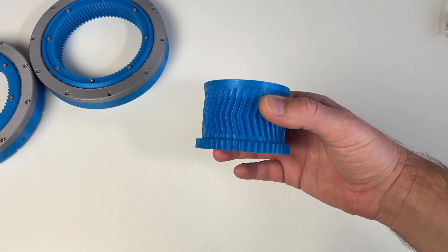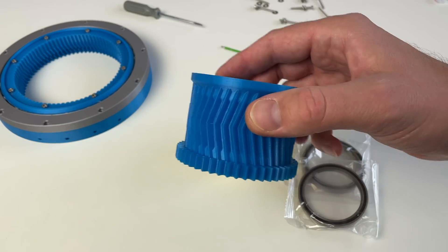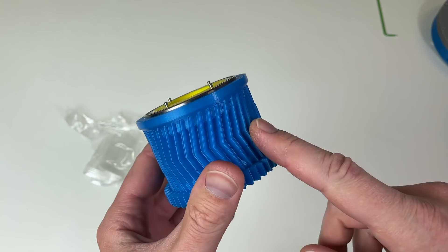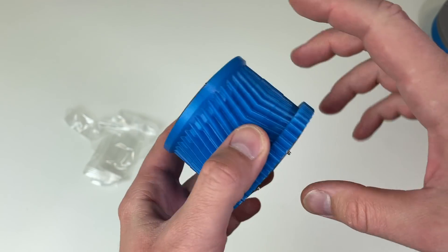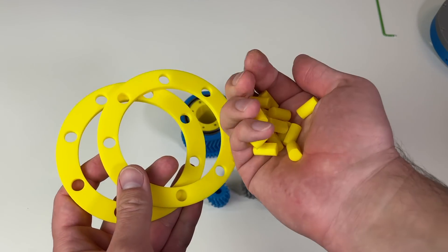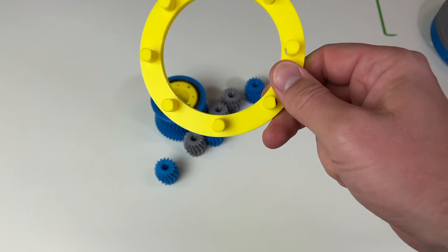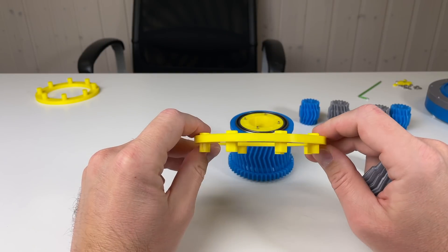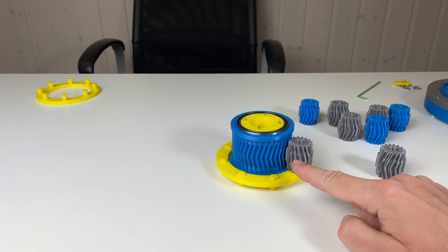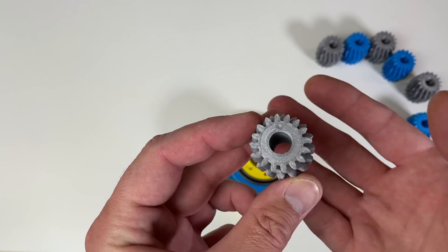Now we'll take care of the sun gear. This is the sun gear axis, with M3 nuts and dowel pins installed. To support the sun gear on the axis I'll use two 6710 bearings. This is how the assembly of the sun gear with axis and two bearings looks. Now we can assemble the planet gears around it. To assist this assembly I made these helper parts. On this ring I properly adjusted the heights of each cylinder so that when I put a planet it aligns perfectly with the sun gear in terms of height. Each planet has an orientation mark showing how it was printed on the build plate.